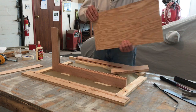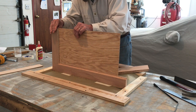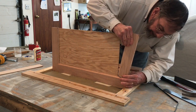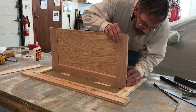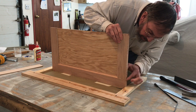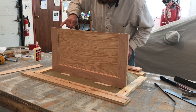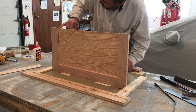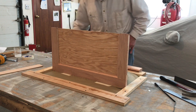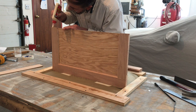You don't want to have to reposition it. You can take and slide the panel into place and position that. Make sure your fit is good, because that glue will start to take a set and you want to make sure it's in the right place. The panel should be about a sixteenth undersized all the way around — we've got about an eighth of an inch under there and a sixteenth on each end, because the panel should be floating. It shouldn't be a tight fit in there; if it is, it's going to probably eventually bust the joints as the humidity of the wood changes.